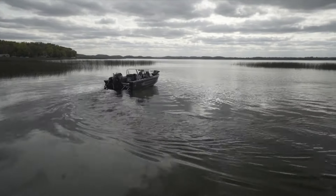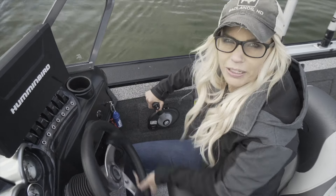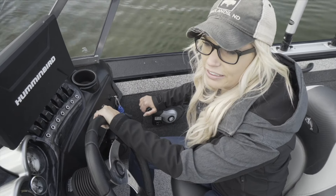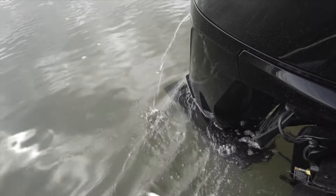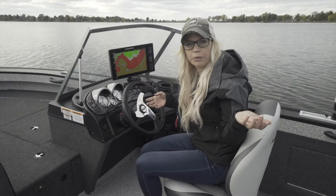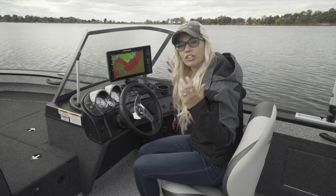No matter what, if you keep your motor straight you're going to have no problem backing up without it swinging into the dock, and then you're going to go cruising. With the boat, your throttle is under here — push the button down underneath the throttle and put the drive into gear. The motor is really shallow right now because we're in two to three feet of water, but as long as the motor is peeing water you're going to be okay. While getting away from the access in the shallow water, take it easy, keep your motor trimmed up, and get to a little bit deeper water before you plane out. Get the boat organized and go for a spin.